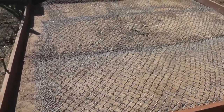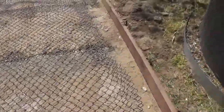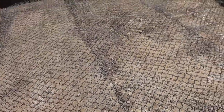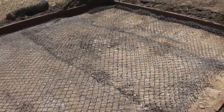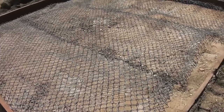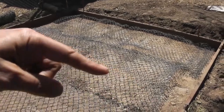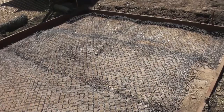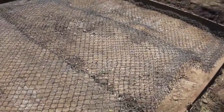The purpose of the wire is to keep the concrete from sloping down or breaking off. Concrete's going to crack. Most of the time it always cracks, and that's due to the moisture evaporating out of it and shrinkage. What the wire does is, even though the concrete is cracking, it holds it together. If it cracks down the middle, it won't let this side slope down or break off or fall off. Or that's the principle anyway, in theory, I guess.